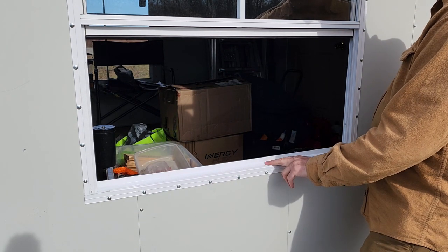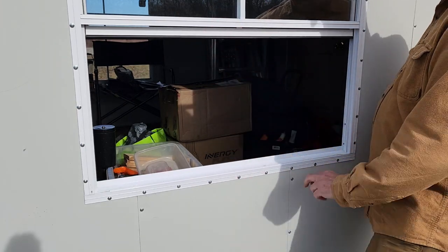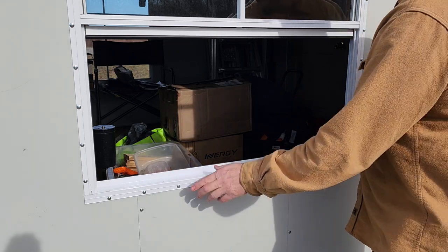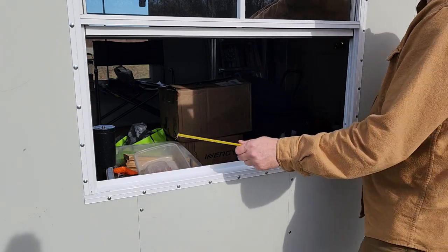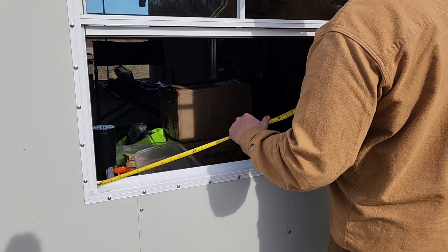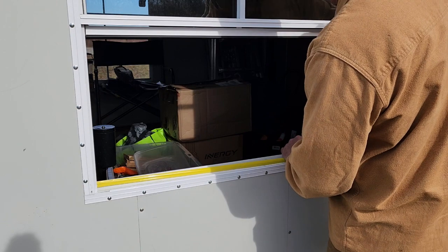The great thing about keeping the wood below this larger lip is that the rain will come down and just go out the two endpoints right here. We want the wood right in between here, up against this taller lip. What we need is the inside dimension of that. So we're going to take our tape and measure that — because remember, the piece of wood is quite a bit longer than what you need. I'm measuring, and this should be a pretty even measurement; these windows are made pretty much by the tens of thousands.